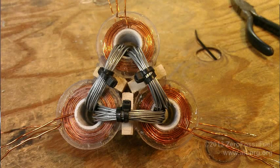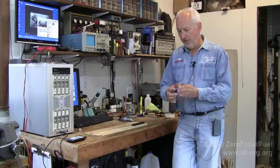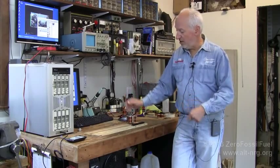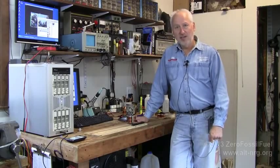In this overhead shot here, you can see the geometry of the three coils together, and also what I'm using for a core. This is just steel wire that was wrapped around the rolls of chicken wire that I used as my Faraday cage when putting together the shed project. I saved it knowing there would be a need for it someday, and today's the day.